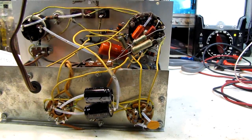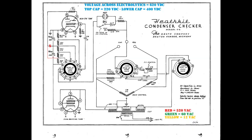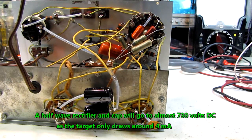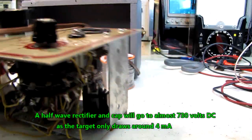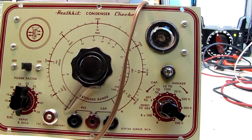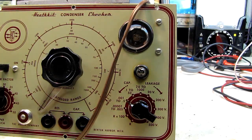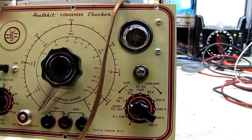If you have an eye tube that's dim, that's worth thinking about. Worst case scenario, as you can see on the schematic, the secondary is 520 volts AC. So if you had to go to a much higher voltage, you could always put a bridge rectifier across that — though now you'd be pushing well over 1,000 volts, so be mighty careful. Or you could take a single half-wave rectifier, just a single diode on a cap, pick off the voltage, and put a potentiometer in there as a voltage divider. There's an endless number of ways it can be done. The whole point of this is to show you that these tubes can be brightened up — you can get a lot more life out of them if there's any glow left at all. Some of them are so far gone there's absolutely no glow, and it's probably pointless. But if they're lit up, at least have a green glow on them — very often you can help them along by increasing the target voltage.